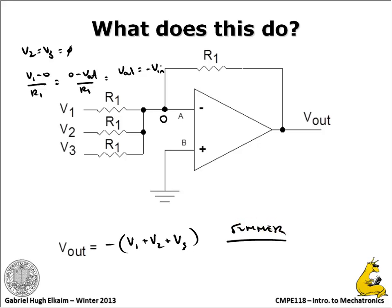Right, so this one I can actually take the sum of all of them, and then just add them all up together. Right, the resistors won't be perfect, although if you were doing this, you might consider using 1% resistors that are more closely matched. Or, as long as you took 4 of them from the same manufacturing batch, they'll all be pretty damn close, even though they might not be exact. But the fact that you're using them in 4 places means that they'll all be quite tightly matched. The same batch will tend to have very little variation among them. They've gotten very good at making relatively little variation.